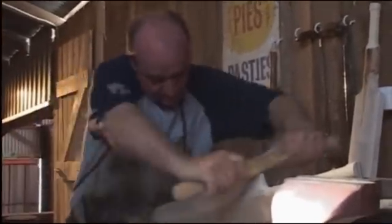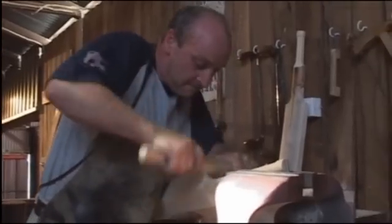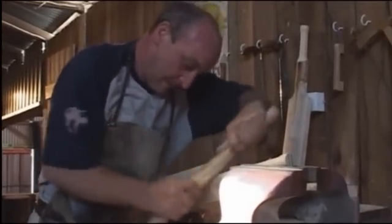Another traditional tool that I like to use is a horse's shin bone. This is actually soaked in linseed oil for 1 year prior to use. This seals the pores of the timber, lays a base amount of linseed oil into the timber and hardens the leading edges.